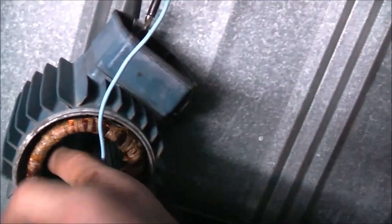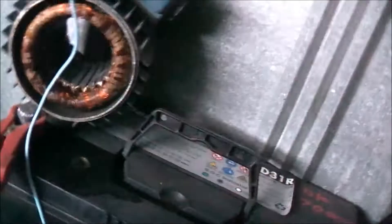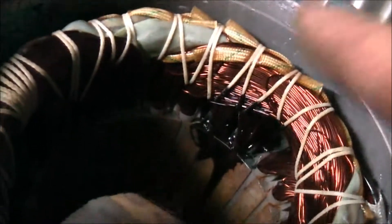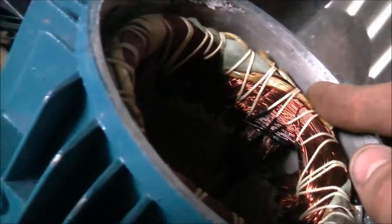I'm doing a technique I just figured out. I'm shorting this out across the battery. I want to feel where it gets hot. I did this technique - short between the windings and earth on a high current source, in this case the truck battery - and I felt here was getting hot. I marked it. That's where the actual short has gone to earth - right here. I can't figure out how it shorted to earth. I can't see a flash, a carbon track, or a breach in the windings or plastic insulation. But she's bloody gone to earth.